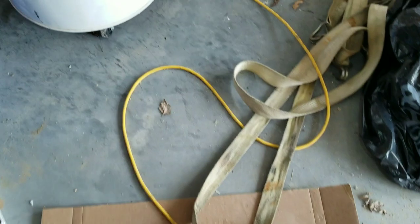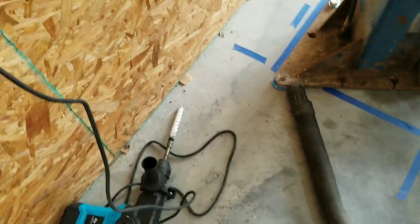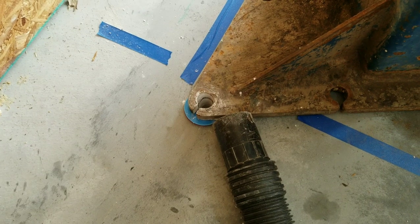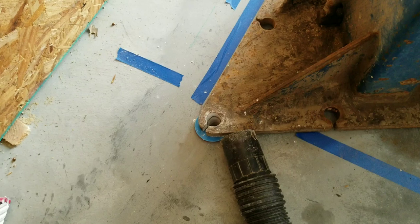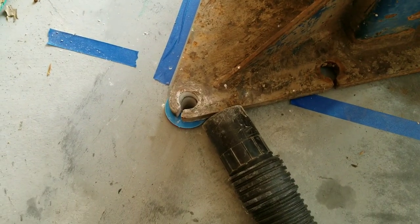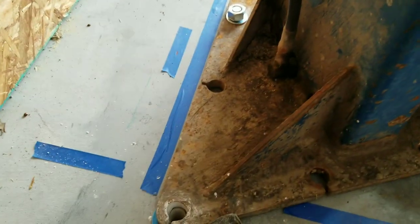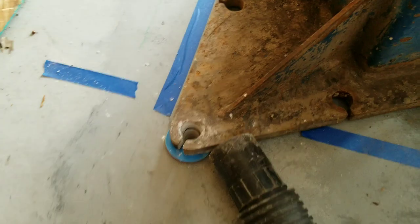I'm going to show you how I do it while I'm drilling this hole. It's a three-quarter inch hole — takes a big rotary hammer. I stop occasionally and vacuum because I don't want that bit to overheat. I don't want to have to buy two bits to do this job, so I'll drill an inch or so and then vacuum up the dust, but there's still some dust at the bottom of that hole.